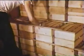Men trained in the art of loading move the boxes into the pre-iced reefers. They are stowed in layers, 7 boxes wide and 10 high, 1,400 boxes to the car. As the height increases, the layers are secured with stripping lath firmly nailed on both the back and front of the boxes to hold them in regular alignment and prevent side shifting.